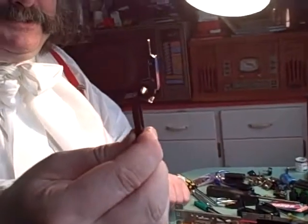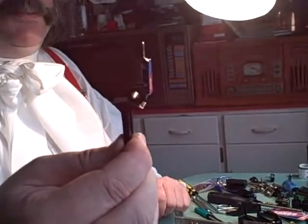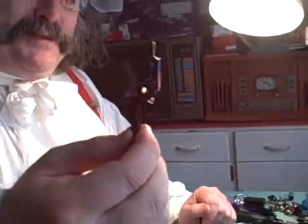So I've had to put two steel rods in it. You could have used brass, but I happen to have some nails with the right diameter. Drilled it, two rods in there, piece of plastic card either side of it, and hopefully once it's all back on its spindle and the mechanism it should work.